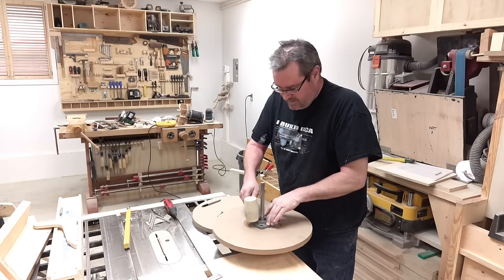So it took a long time, and I had to stop there because I'm drifting downwards and the saw's almost stalling. So I don't know what the reason for that is. Maybe it's the width of the cut that I'm making here. Maybe I need to crank up the tension a bit more. I'm just going to try to break that free.